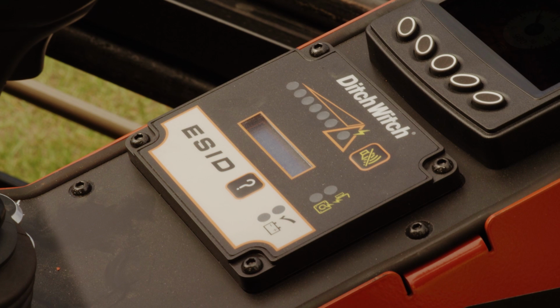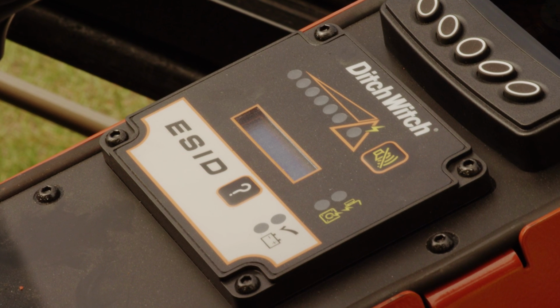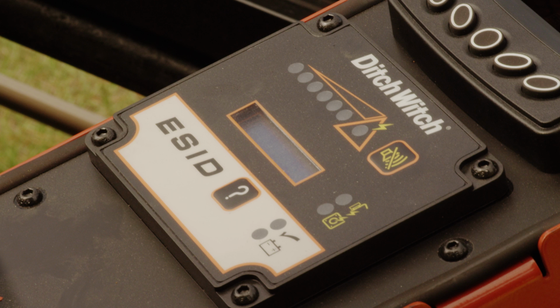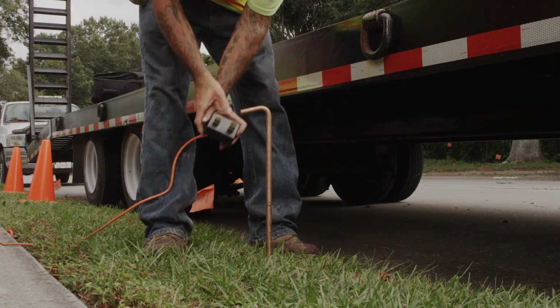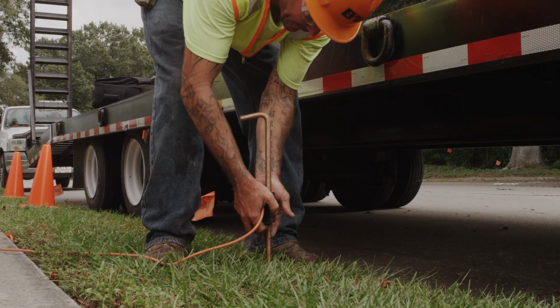It is important to use your electric strike indicator while drilling. This system is there to help protect and warn you and others of a possible strike. The system detects when a strike has occurred. It consists of a voltage stake. This is to be located away from the machine. It detects the voltage difference between the ground stake and the drilling machine.